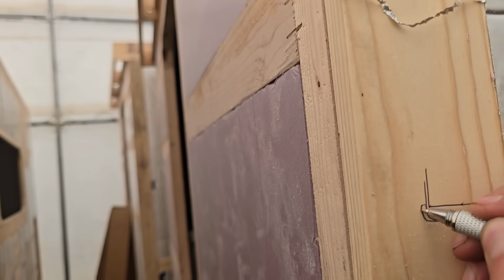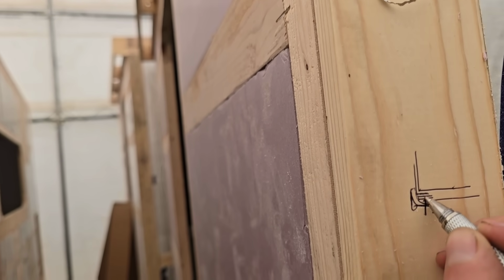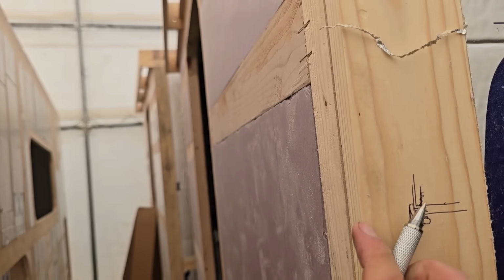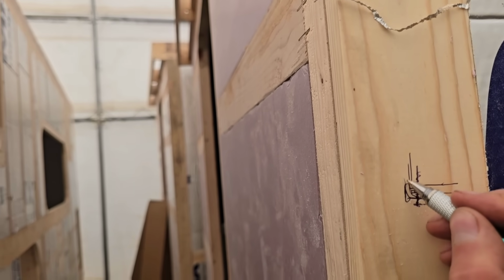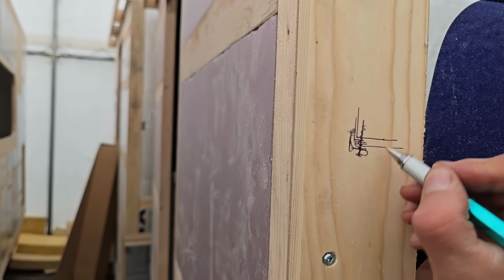And then on top of that, you have a rail that gets screwed on. And then your fastener sandwiches all of this, right? That's how that works. And then this gets installed into the corner, this rail, so it pushes. Then you let this putty tape ooze out for a day or two, something like that.